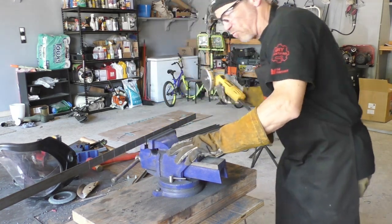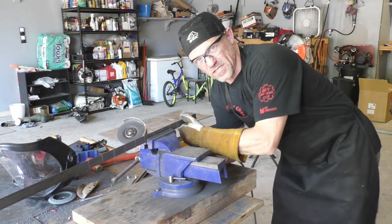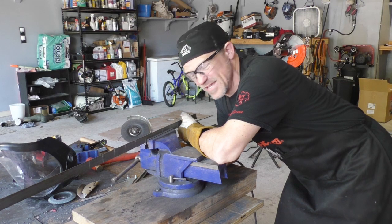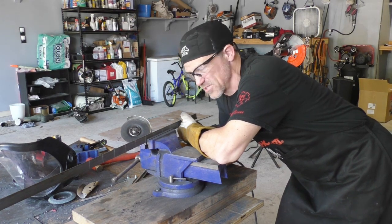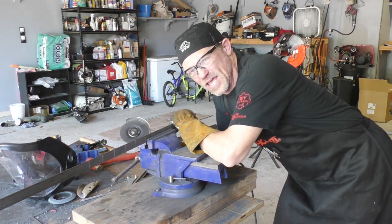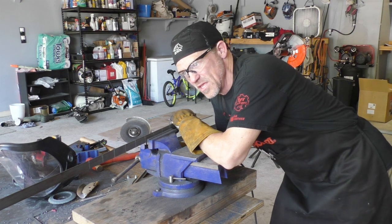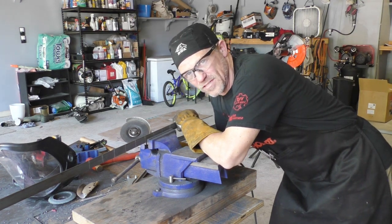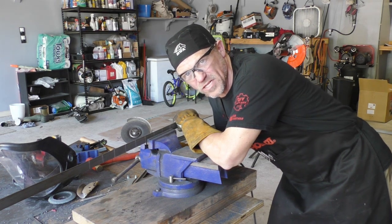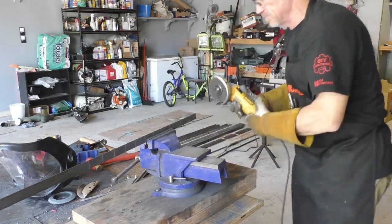And if you're wondering why I'm not cutting these on the chop saw, cutting a real thin, small piece of metal like this on a cold chop saw like that, you can mess your saw up. If this slips out or one of these little pieces of metal get caught up in the blade, I have heard several cases of this messing saws up. So if I have something real small like this, I just cut it with the grinder. It's not worth jamming or messing your saw up or breaking a tooth over a little piece of metal. It's not that hard to cut anyway.